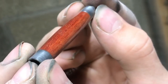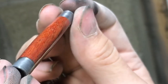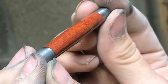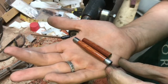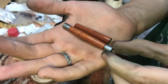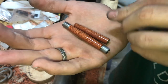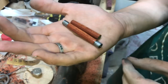And that right there is what all the work is for — an almost flawless finish. There are still a few points where I need to keep buffing it, but it just looks like glass over the wood. The CA finish takes a lot more work than some other finishes, but it's really worth it for the outcome. Once these are buffed, they always look amazing and it really makes or breaks the pen. All that work that goes into getting this finish perfectly flat is worth it, because if it's still uneven, that line will show it. So make sure everything's flat — the extra work is definitely worth it.